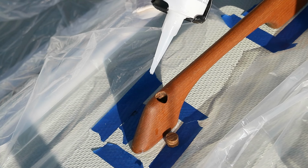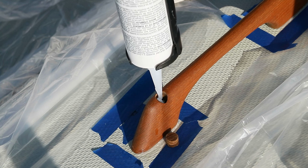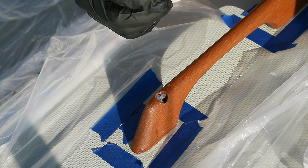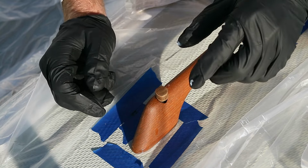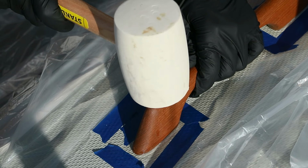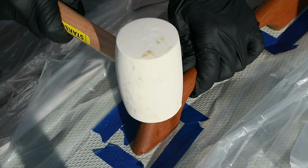Now it was time to seal away the through bolt that started this entire project. I coated the edges of the hole with silicone sealant as well as the top side of the bolt. Then I grabbed a new bung and put it into the bung hole. It did not exactly fit perfectly, so I gently hammered it in with a mallet. You have to be very careful doing this because you could easily split the teak grab rail. If I were to do this again, I would probably try sanding down the bung to make it smaller instead.